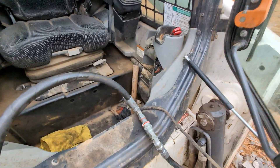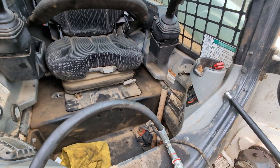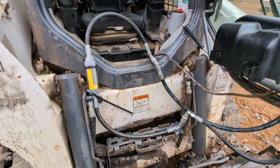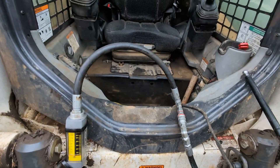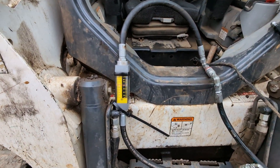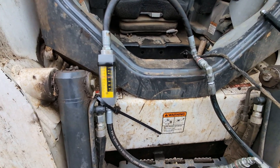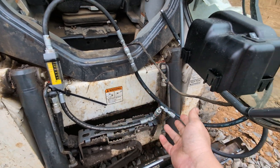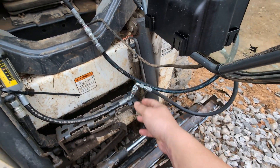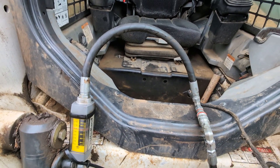I'll disable the appropriate safety mechanisms, get the auxiliaries on. At idle, this machine is pushing about 11 gallons a minute, and as you can tell nothing is jerking around, everything's working good, no leaks. We can add a little RPM here.